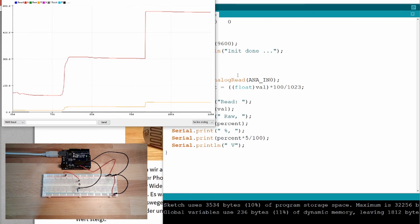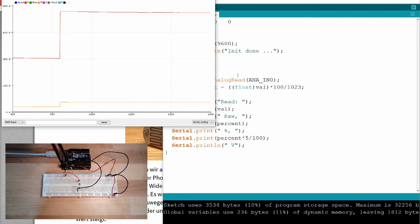It's not a big thing, right? I mean, it's just a voltage divider, like we used in our introduction into analog inputs. Okay, when you remember, your task with analog inputs was that you should turn on and off the brightness of an LED. You can now use exactly the same program you programmed there with the LED. If the ambient light is dark, the LED will get dimmed, and if the measured brightness is high, the LED will get brighter.